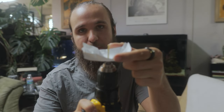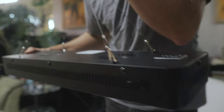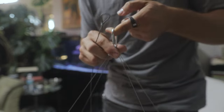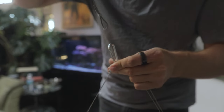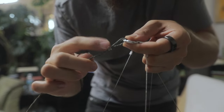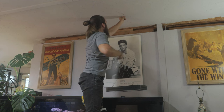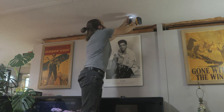So, because I have a wood ceiling in this garage, I'm just gonna use some eye hooks and put them straight into the wood ceiling. I got this drill bit with some paper so that I can drill and not drop any sawdust onto the top of the tank. I have some wire to hang the light. I'm gonna get the light attached to the mounting hardware — it comes with a carabiner, so then we will just hang the light from the wire that I made, put this right through the carabiner. That'll be the attachment point to the ceiling. Since I got the height about where I wanted it, I'll make a second one to match the other side at exactly the same length.